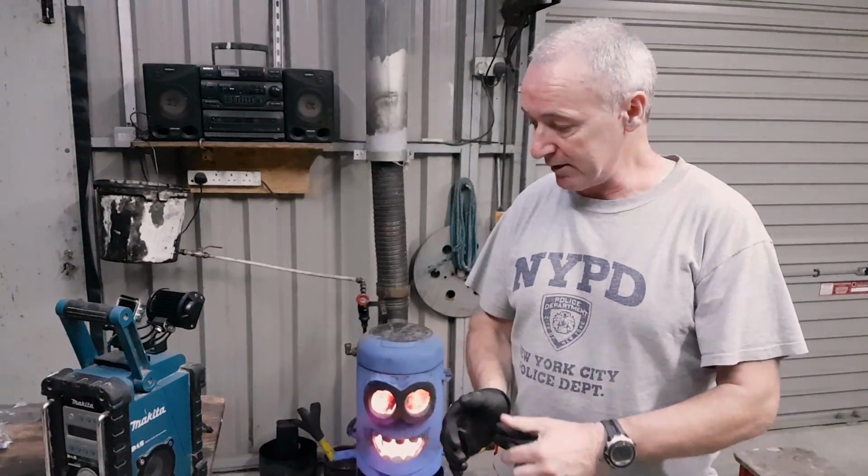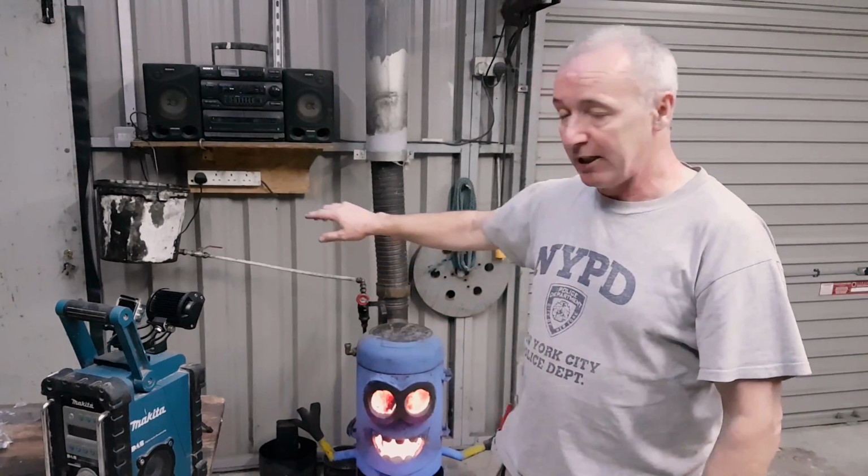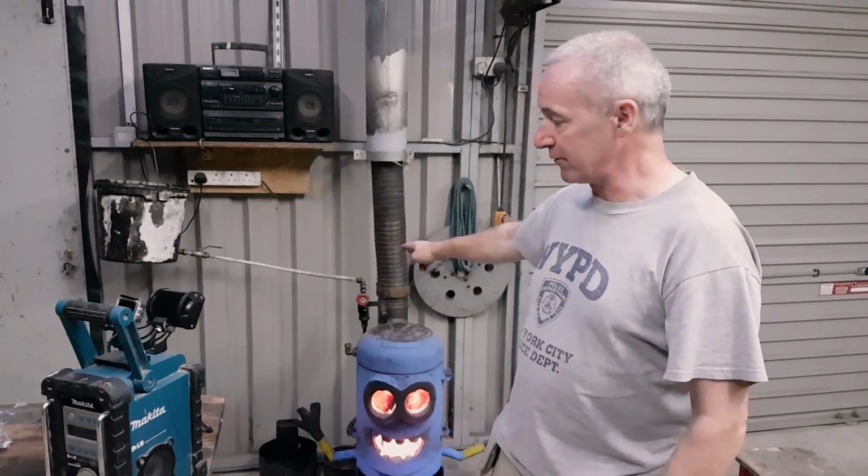Very hot on the sides. Now, when you get this thing working, you don't want to have to go near it, so you need everything set up. Some of the guys have peristaltic pumps, and some people offered me pumps as well, and thanks very much, guys. Essentially, a pump would be better than a gravity feed because it won't change. It'll pump the same volume regardless of viscosity.